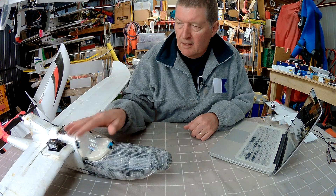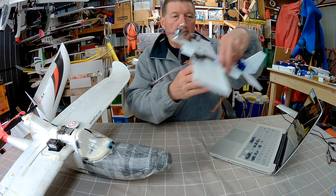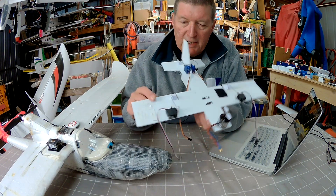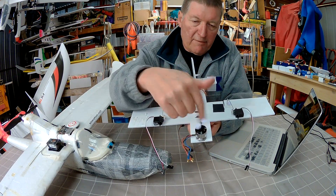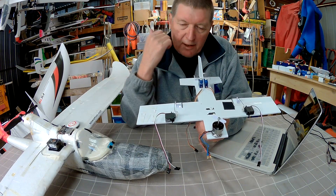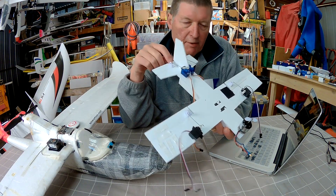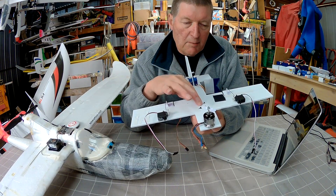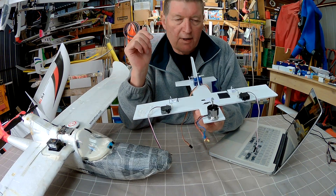Before I even mounted the flight control board on the Bixler, to get my head around how it works I made up this little test plane — never meant to fly, it just has servos, control surfaces, and a little motor on the front. The reason being I could sit beside my computer, plug the flight controller board in and out, and easily muck around with servo directions and throws and see that it was actually working. This helped me a lot — I strongly recommend doing that. It's quite fun and quite easy.